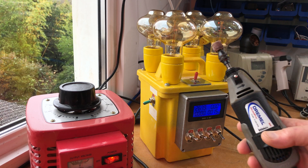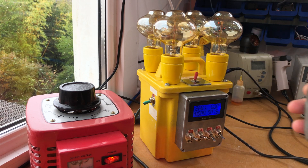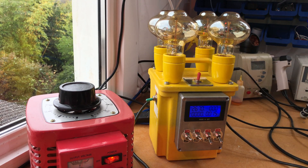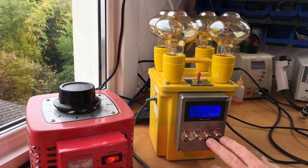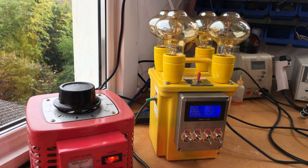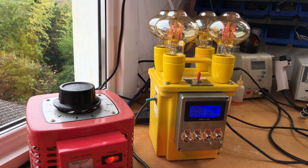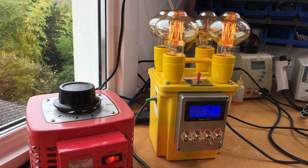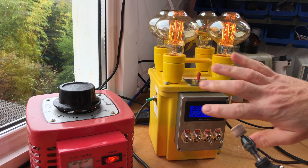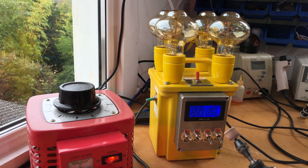Okay, I've got a Dremel plugged in here now. At the moment I've got two of these switches on, so if I turn this on it's going to draw some current and should light up two bulbs. So that's limiting the current supply — it's showing 70 watts. If I press the bypass now, which takes the bulbs out of the circuit, that's full power.